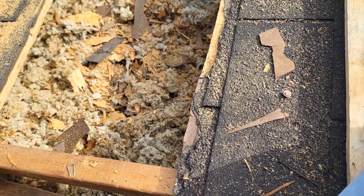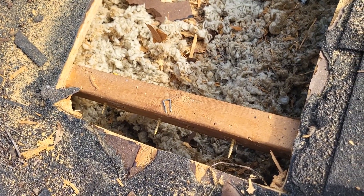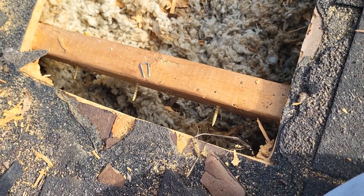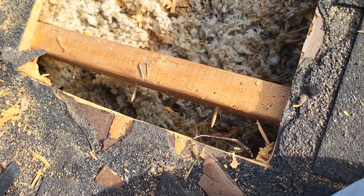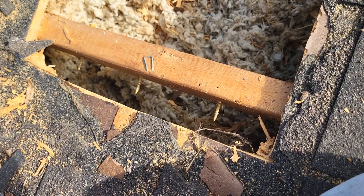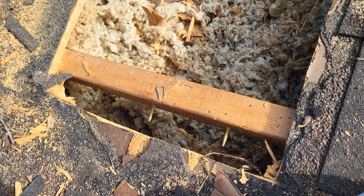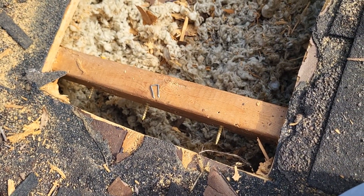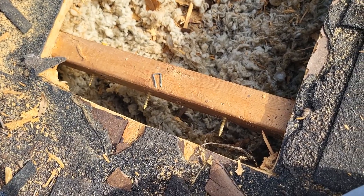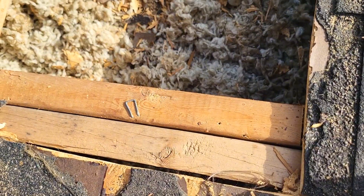I'll do the same with the sides in a different fashion. One thing I noticed: if you start the screws first like I did these three and then back them out, it'll be a lot easier when you're trying to hold the two-by-four in that spot where you're screwing it in from the opposite side. Put the screws in, back them out, then put the two-by-four up under there and it won't push the two-by-four away. Just another quick thought. Then a few seconds later the two-by-four's there.